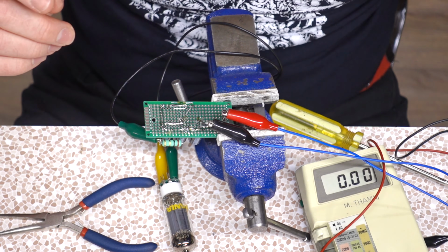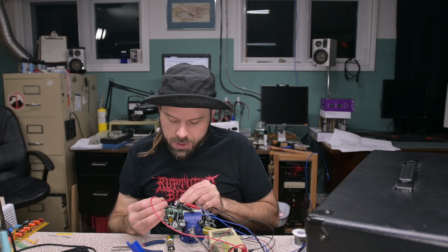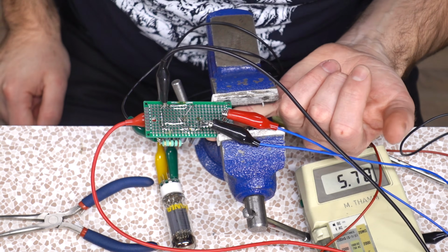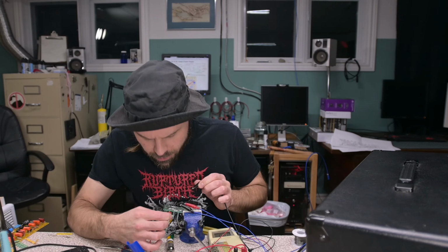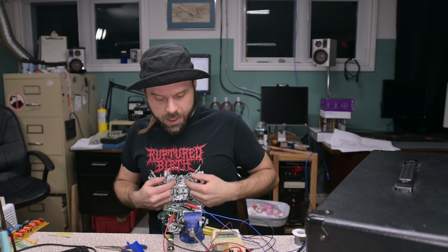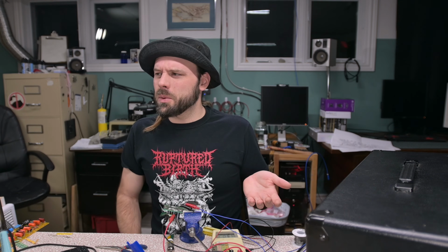Now let us hook up our double test tube here. You're not gonna be able to see the light glowing with the studio lights, but now let's check our output voltage. 5.57, 5.58. How's our diode bridge feel? Little warm, tube's definitely lit. Now let's test voltage drop across one of the resistors. 0.6 volts. Jeez, I should look at the Jet City. It only has like 1 amp diodes in there with the 1.2 resistors. Hasn't given me any grief yet.